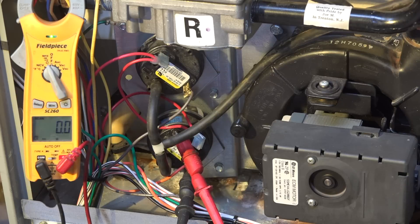The inducer just came on. It's like the pressure switch just closed because I'm now showing zero ohms across the pressure switch. So what's wrong with this furnace? Is there a part that needs to be replaced? Is there some sort of blockage or something like that? You tell me — I'll be back in a few days with the answer.